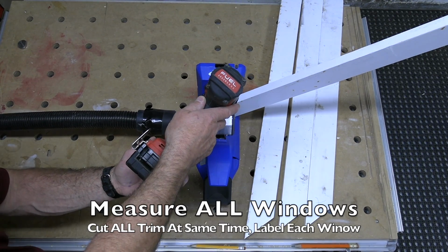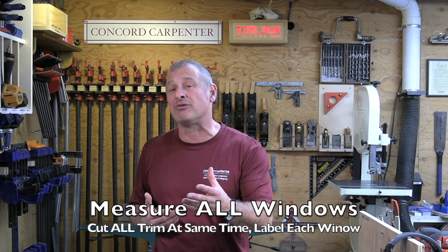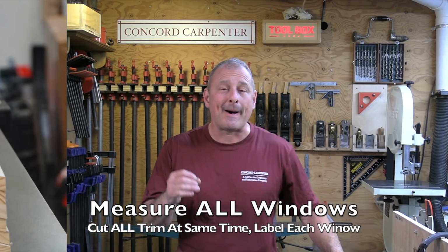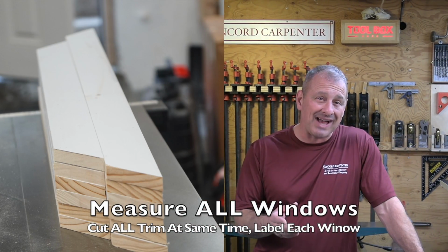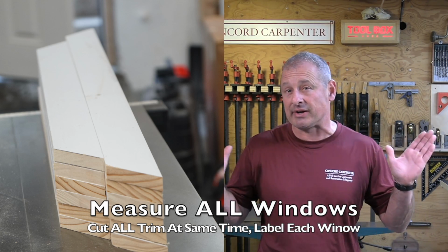So pre-assembling with a Kreg jig probably works best with 3/4 inch trim or larger, but you can do it with 1/2 inch trim as well. Now, if I need to, I rip my trim to size, but then I bring it all to the miter saw and I cut everything to length and start cutting my miters.